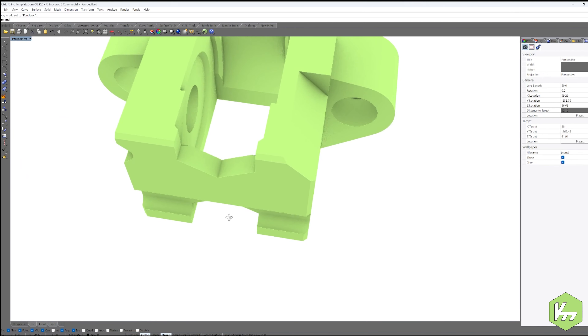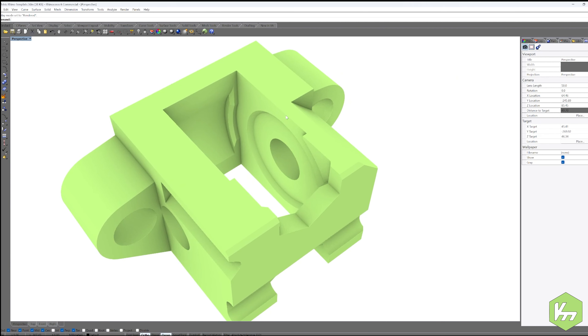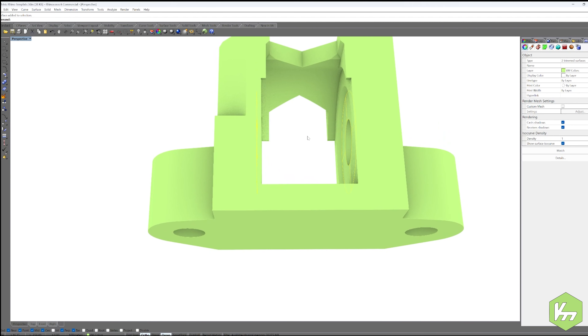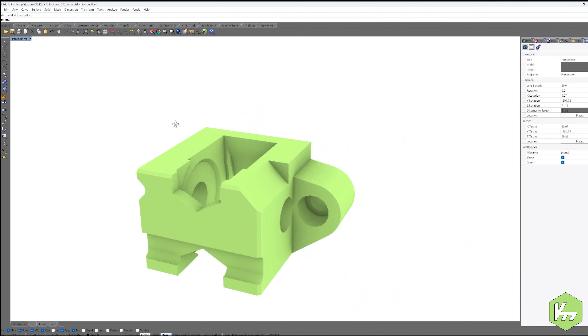The main reason for modifying the file was something else. There used to be round pieces that I didn't like — I wanted to be able to use a pick or something to help align all the pieces, so those were removed. The other major change was the actual spacing: Ramalama's stock configuration is 10.5 millimeters and I needed it to be 10 flat, so I brought those in 0.25 millimeters on each side to shrink it up.